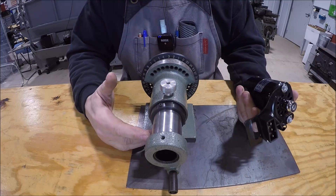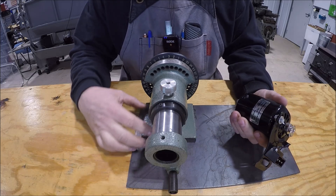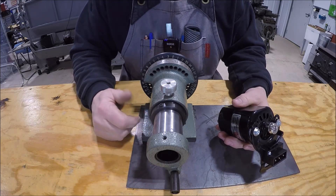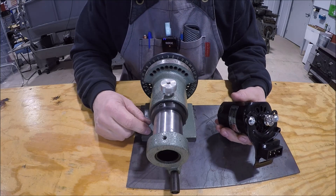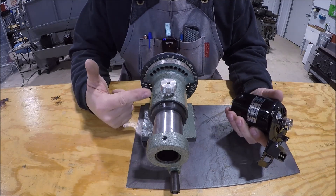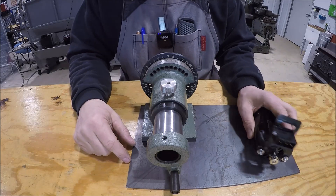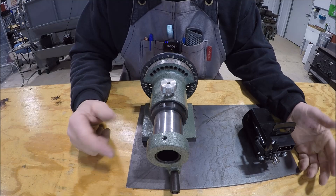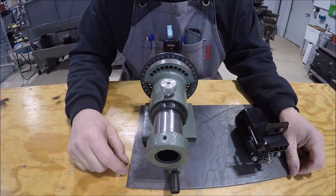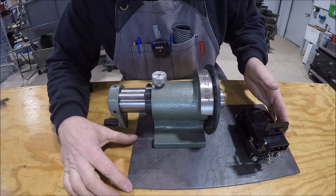The sewing machine motor is 7,000 RPMs. I talked to Robert over at Dudley Tool - he has a nice fixture he scored off eBay at a real good price, I think it's a Herig, and his runs at 3,450 RPMs. So if we just do a two-to-one pulley reduction that'll take this down to 3,500 RPMs - right there in the ballpark, perfect. I don't have to do some sort of voltage reducer and possibly lose some power. A two-to-one pulley ratio should get us right where we need to be.